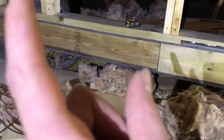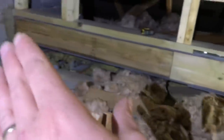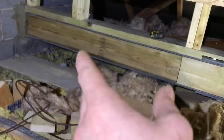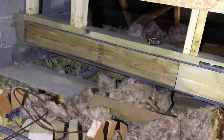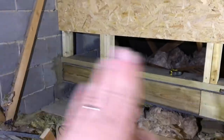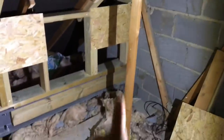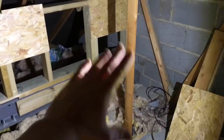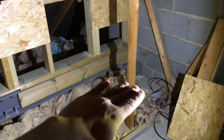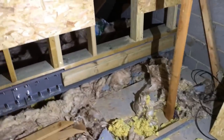As you can see, the wood we cut out is for these sections — for that splice there and that splice there. We've now got this fixed in, and then once we've got our floor joist in, the tight fit — this is literally acting as a packer, it's not acting as a structural element. So we've screwed it from the back, and then screwed it from the front, and then the long joist hangers will go over, and then we can finish this wall. Not today though, but hopefully we might get a Velux cut in today, potentially. We've got some space up here now. We've got to put a temporary one in there because this bedroom is literally the whole size of this, and obviously we're walking on this still. But once we get the floor in, we're going to have to do some sort of bracing off the new floor — we'll get to that when we get there.